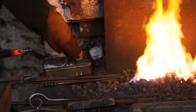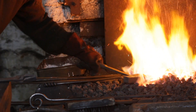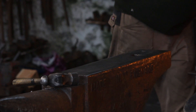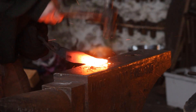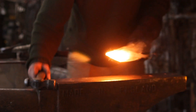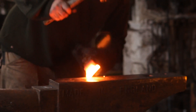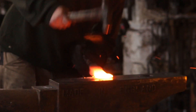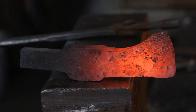Give it a bit of a flux before starting, and into the fire. I am using the drift here because it's a bit easier than the tongs. Take a decent welding heat and weld it all together. My usual technique: one heat to tack, one heat to weld, and then one heat to blend. There may be another heat here and there just to weld up areas that haven't quite taken. Make sure you close up the outside edges as well. And here we have the bit welded into the body of the axe hammer.